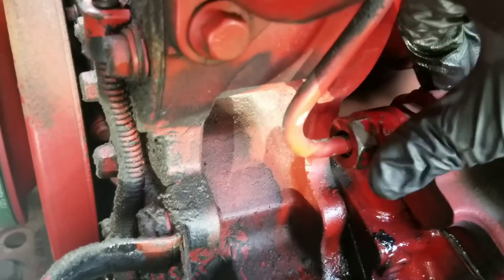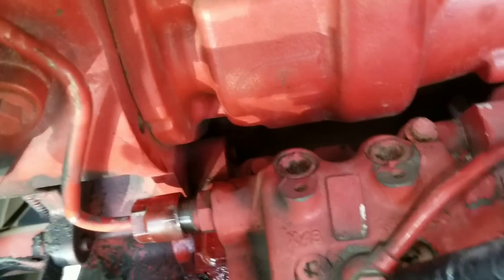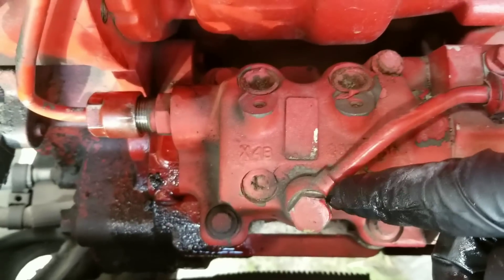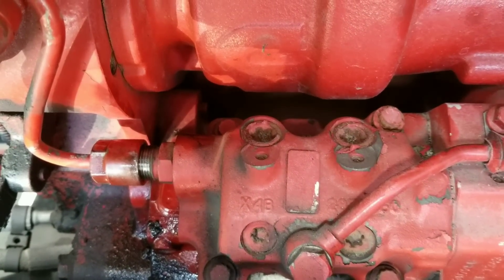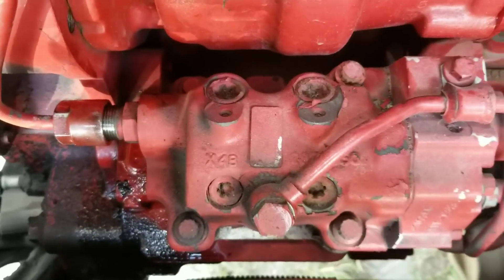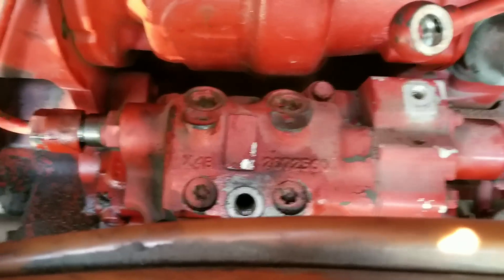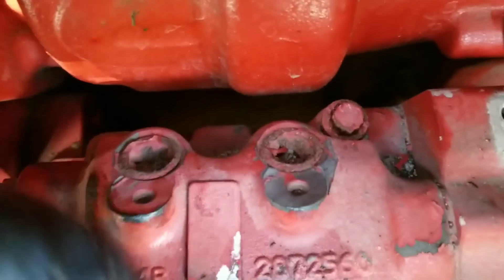This is the other end of the fuel pump fuel rail outlet. I have to disconnect the banjo bolts. These are the head drains and I have to disconnect that plug. I remove this line — it's connected with a banjo bolt using a 17 millimeter socket.